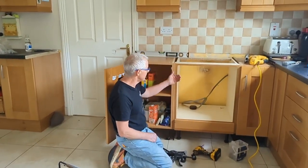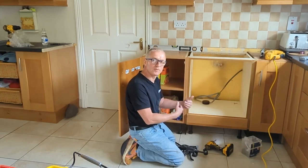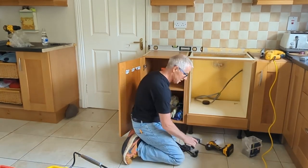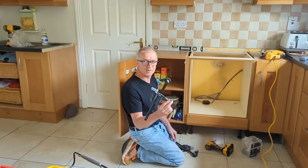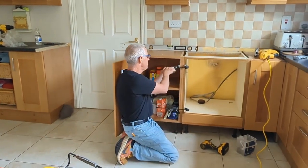A little tip when you're out on site and you're fitting two units together: you want them to be held firmly while you're screwing them so that something doesn't go out of line. These guys you can buy in the discount store — just quick clamps. You can pop one on the bottom, pop one on the top there.